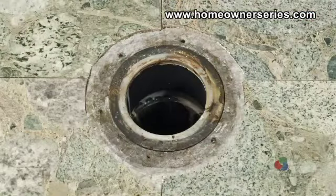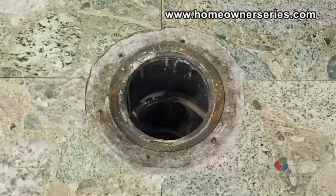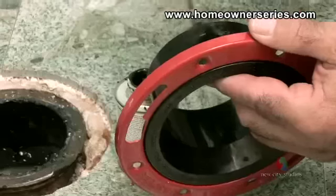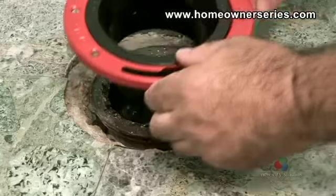Now test to make sure the new replacement flange fits into the sewer inlet properly, as sometimes a plastic ring left behind from when the inlet was built will need to be removed. Apply ABS glue to the inside of the sewer inlet and also to the replacement flange.